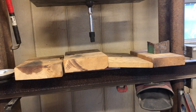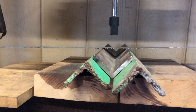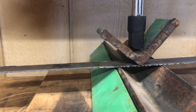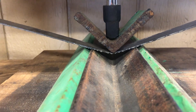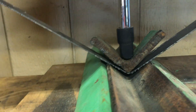The airline just hooks up to the shop air and drives it right down. I don't have a press brake for making angles, but I'll get set up and show you how I do that without a dedicated jig. I just put three pieces of angle iron up here in order to bend stuff and make a 90. I need to realign it a little bit — there we go, and back down.